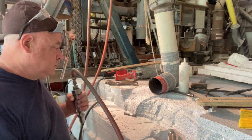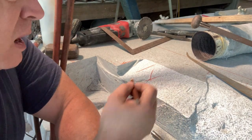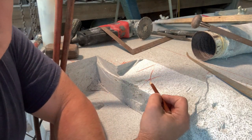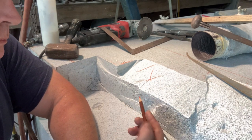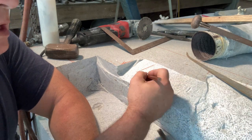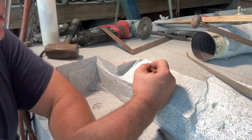We're going to shoot this point on her shoulder — there's a point right on the top of her shoulder. You see these three lines here — they don't cross very well. But we understand as they come in, this one here is from the bottom. That's the long one — that's not going to move a lot because it's a long radius. This one's the shortest radius of the bunch and it's going to come down to where it isn't quite flat to the back, so this line will move a lot.